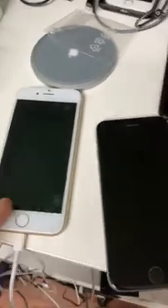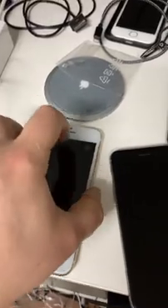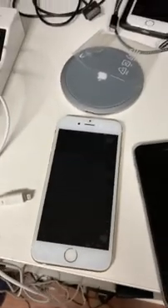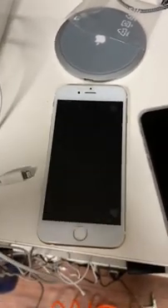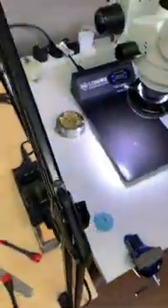So this is a quick test on a simple USB charger with a screen. What that means is there is a short here, and there is no short in that one. I've also diagnosed with an infrared camera — it's a very common one, located in the top left corner, which is the Wi-Fi chip. The phone will drain the battery when the Wi-Fi chip is shorted internally.